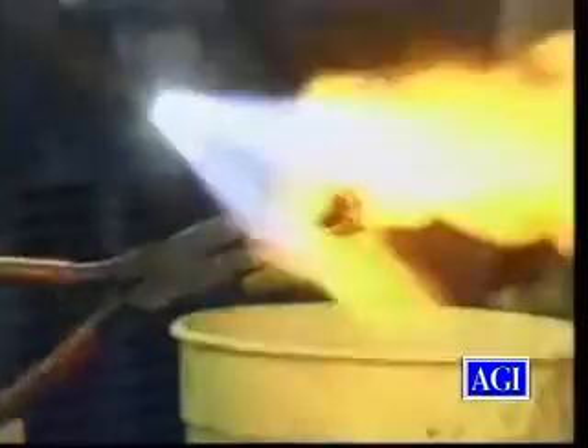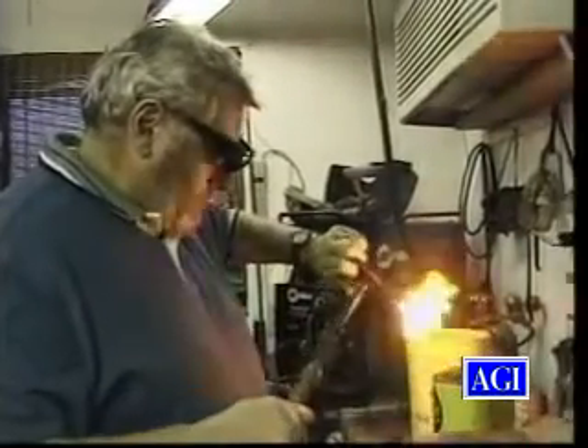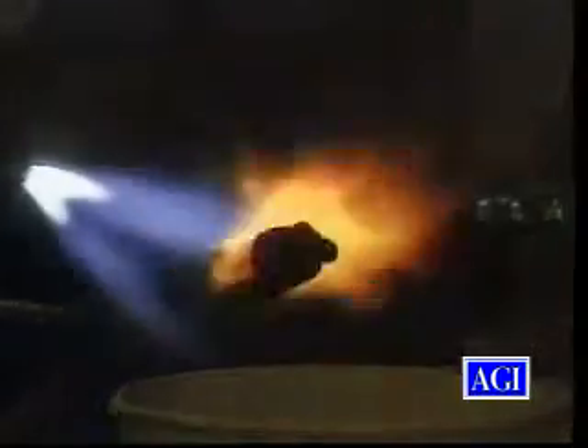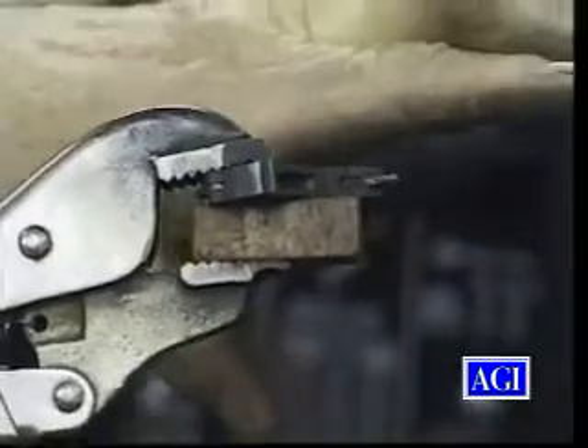Wasn't quite hot enough then. It is now. I'm going to do this for about five more minutes, and during that process I'll reapply the case-hardening compound probably two or three more times. It's been about five minutes. If I was doing this for real, I'd put another copper block here so that no heat will get past this.